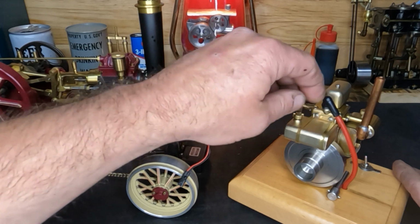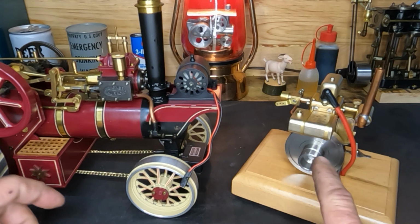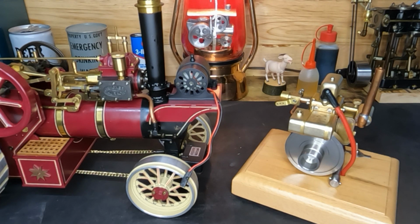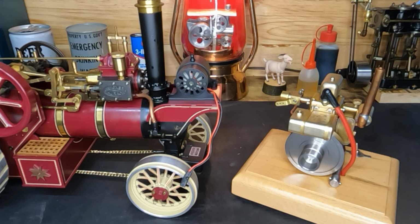And when it comes to fuel, I know there's been a couple comments made about using a syringe to fill these up. I really hadn't paid a whole lot of attention to it, but the comments were right. Those rubber plunger syringes work, but if you're using something like gas or solvent, they'll make that rubber expand, and when you go to pull the plunger out to draw it in, it just pops off the end. So they're not worth a dang for what we're trying to do. WGB is the one that had recommended that. Congratulations, you're right, and I did find out.